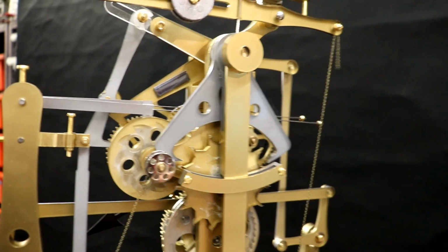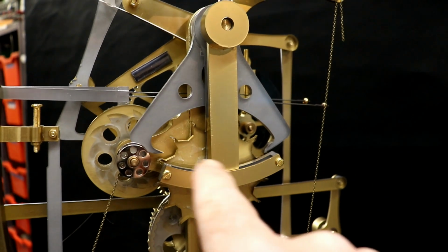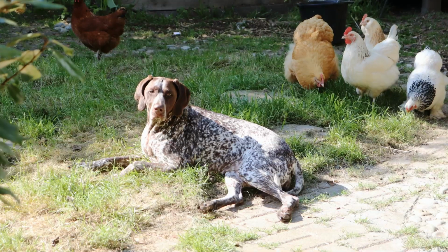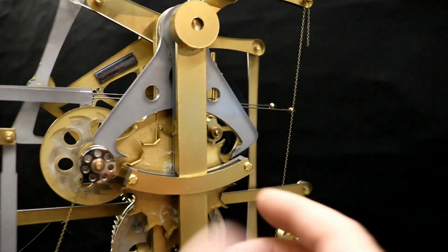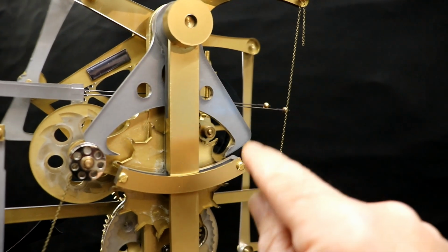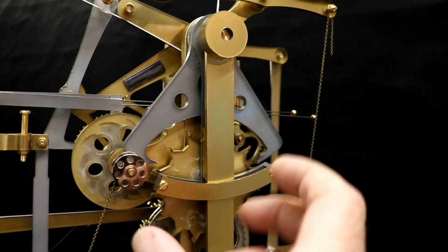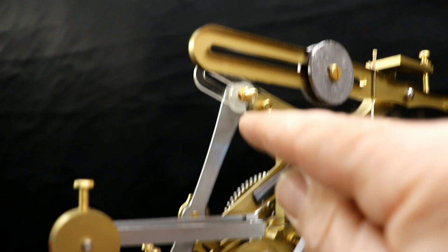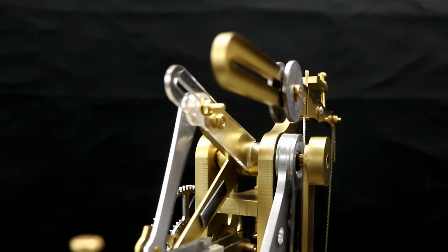I think I might have mentioned, but the problem now is that having put graphite powder on the pawls for the escapement and the escapement itself, it's changed the whole way it works. So I've just taken Ziggy for a walk and she came up with some great ideas. I was all in for adding bearings and designing a brand new escapement, which I have no idea how to do. She said, before you do that, bear in mind that as the graphite wears down and the pawls wear down and smooth themselves against the escapement prongs, the mechanical features are going to change. She suggested adding something here to make this pawl longer, or the turning force longer, and that's what I did. Thank you very much again to Ziggy.